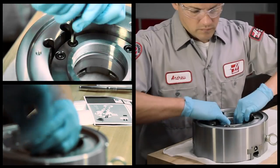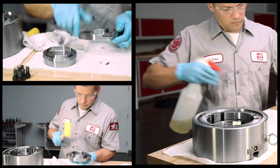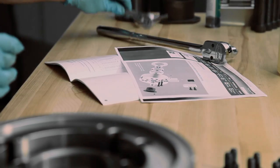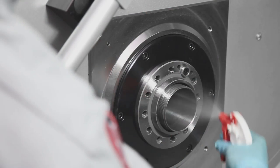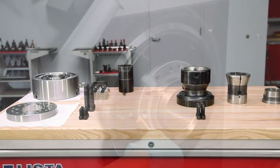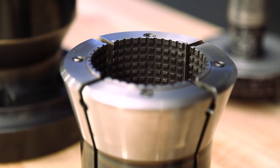If it's been more than six months since the chuck was last removed, now is a good time to disassemble the chuck for cleaning and general maintenance. Reference the documentation available from the chuck manufacturer for the exact steps involved in servicing your specific model of chuck. Move to the spindle face and clean it with WD-40 as well, again followed by a check with a fine deburring stone. With the spindle face prepared, it is ready to accept either the original chuck or collet-style workholding.